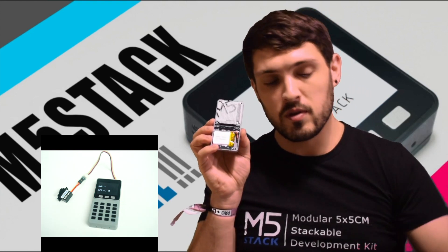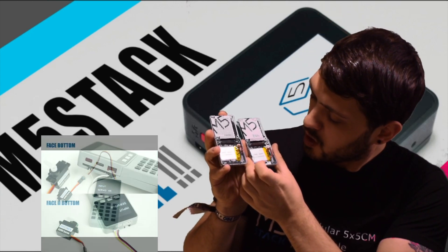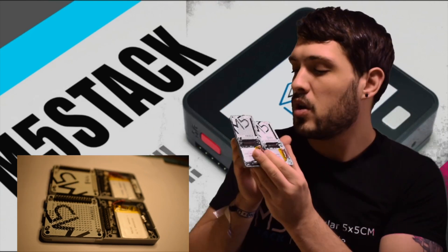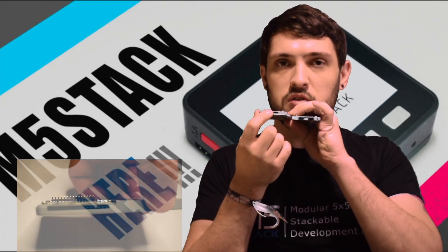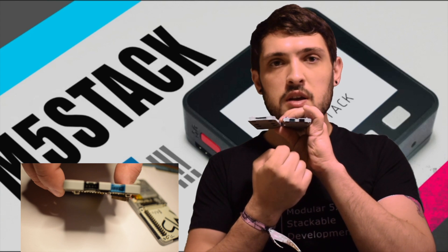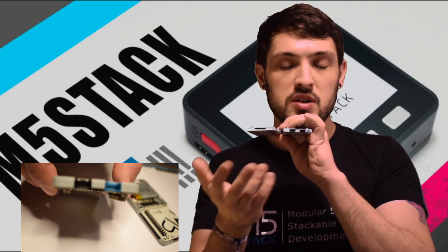The Faces 2 is compatible with all of the previous Faces kit modules. Looking at similarities and differences: we've got the same 600mAh battery, a lot looking similar with the circuit board, but one big difference — instead of a plain PCB, this is a breakout board. The original Faces doesn't have any ports here, just a bunch of pins, but the Faces 2 has two ports: port B and port C. Port C is for UART communication and port B is for GPIO, whether analog or digital.